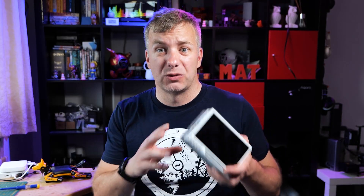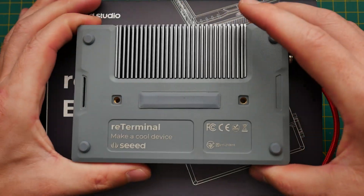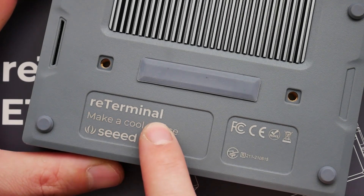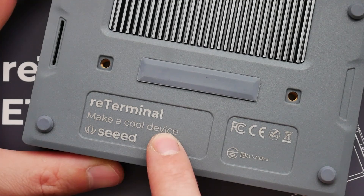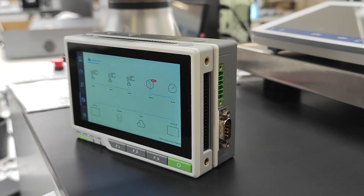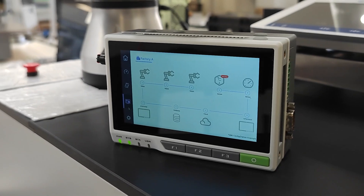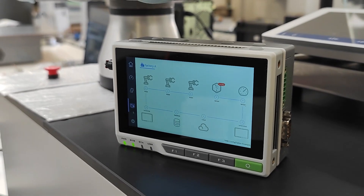I think all my remarks about the ReTerminal E10-1 won't encourage you to buy one unless you're very specific about the use cases. And to be honest, that's okay because this device isn't made for you. While the ReTerminal itself was marketed to makers as a really cool device that can be used to realize your projects and ideas, the very first expansion board, the E10-1, isn't really what makers are looking for. This add-on serves another purpose — it's made for heavy duty industrial automation, and a person like me will actually appreciate this. In the world of industrial automation everything runs on 24 volts, we use RS-485 or RS-232 and CAN bus instead of other protocols. And this is exactly where this add-on shines.